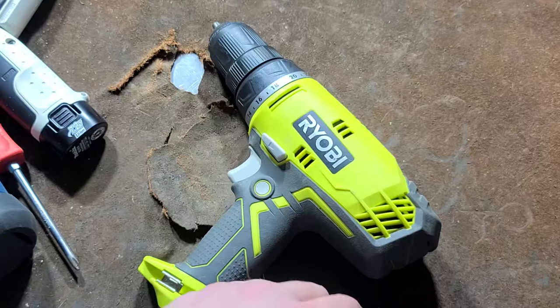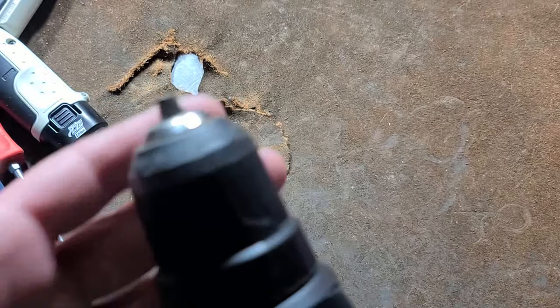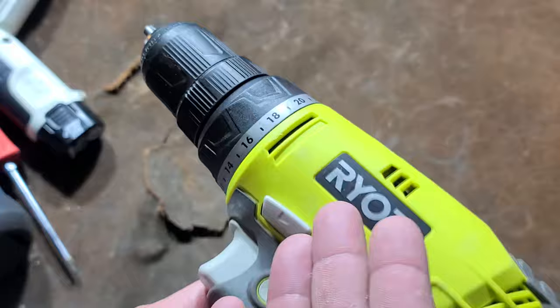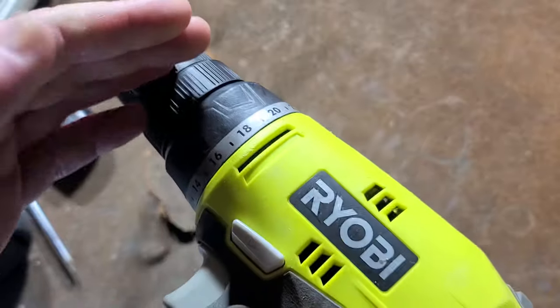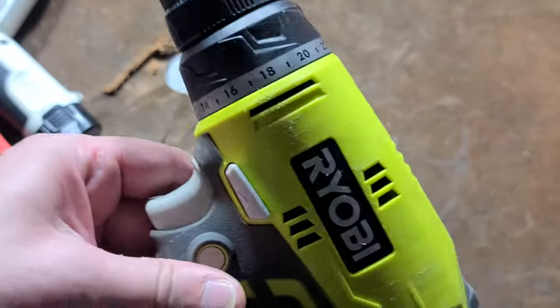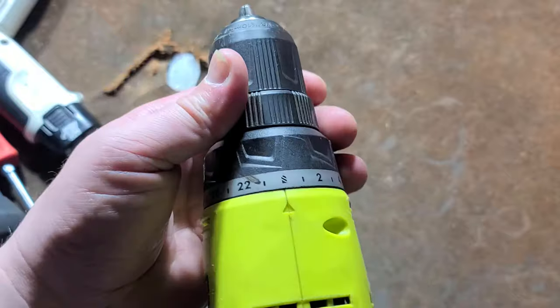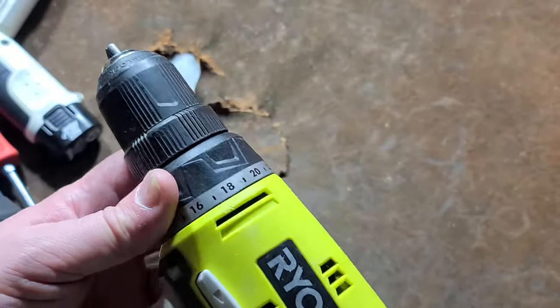This is a corded version of essentially a traditional cordless drill, having the adjustable clutch collar for clutch settings as well as the usual drill mode which doesn't allow the clutch to slip. Pretty cheesy chuck, but it was a pretty cheap drill. Ryobi, because of the clutch portion, it was actually cheaper for them to basically use a cordless drill front end and a corded motor. So this actually has a planetary gearbox — very rare on a corded drill — and it's surprisingly robust. Planetary gearboxes are very strong and long-lasting, just a little bit more expensive to make, but in this situation they're just using cordless drill parts.